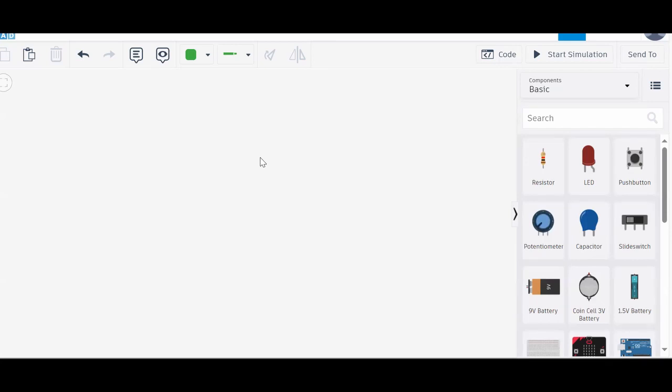Is it possible to detect an object in front of our device? The answer is yes, using an ultrasonic distance measuring sensor or a PIR sensor. I would prefer the ultrasonic distance measuring sensor because it provides a higher level of precision and control. And for opening the lid, I need to provide some sort of motion, correct? I will get this motion from a servo motor. Okay, so now let's start the connections.